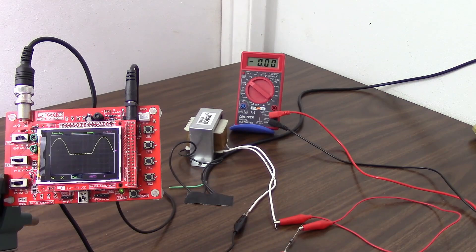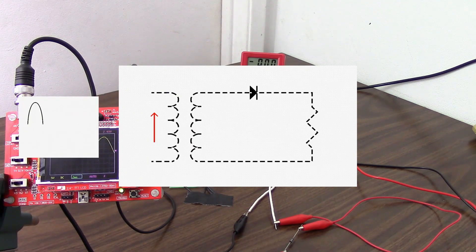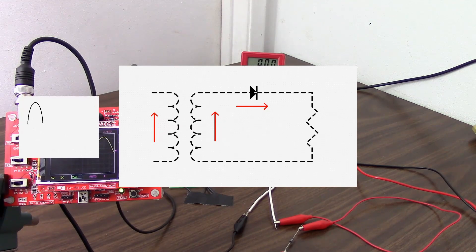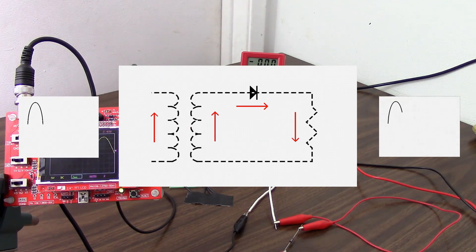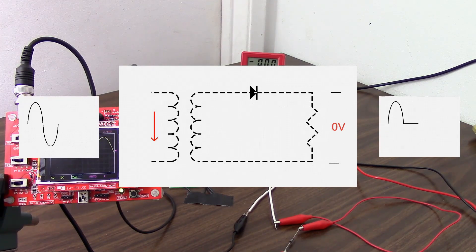Let's step back a moment and take a look at how the half-wave rectifier works. During the first half of the cycle, the current travels through the primary of the transformer in this direction. In this transformer, it then travels in the secondary in this direction. That makes the current travel through the diode in this direction — this forward biases the diode and it conducts current, so the current goes through the resistor in this direction. So the voltage across the resistor follows the voltage in the primary. During the second half of the cycle, the current travels through the primary in this direction, so it attempts to travel through the secondary in this direction, which causes it to attempt to travel through the diode in this direction. Since this reverse biases the diode, no current flows in the secondary circuit, and so we have no current flow through the load. With no current flow through the load, we cannot have a voltage across it, because to get a voltage we must have both resistance and current.